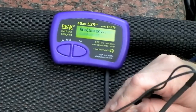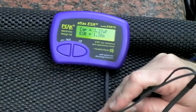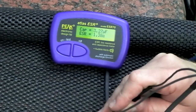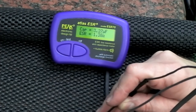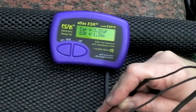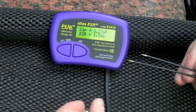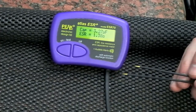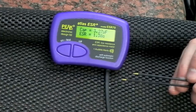We've got a reading of 3.27µF at 1.38 ohms ESR. That compared earlier with a value of 3.3µF — so that's pretty much spot on. The ESR earlier was 2 ohms and we've got 1.3 here. I had calibrated this earlier on, so it's going to be as good as we can get.